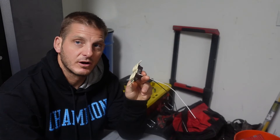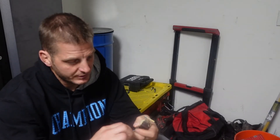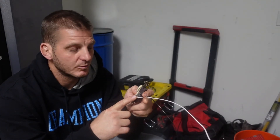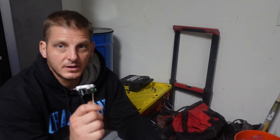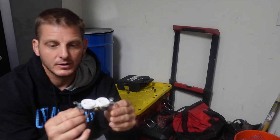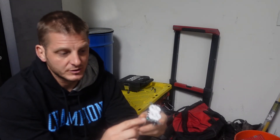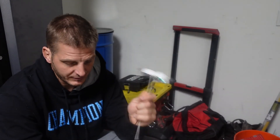If you have a two-wire setup with a metal box and the grounding wire is connected to it, you'll want to test continuity between the box and your white wire. If you get continuity between the box and the white wire without them touching, go ahead and connect the ground — that tells you the box is grounded. Once you tighten down the screws — which are also grounding screws because they're machine thread — the yoke is all tied together, so you're good to go.